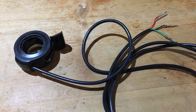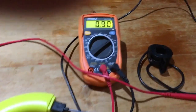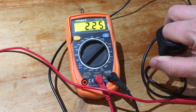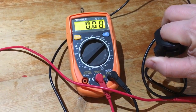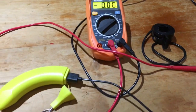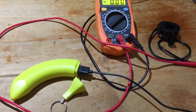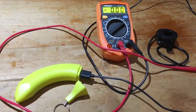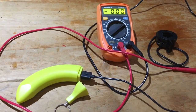So the throttle is resting at 0.9 volts before the BMS cuts out. I can probably scale it up to about 4.3 volts before the BMS trips on the old trusty banana power supply — so resting at 0.9 volts and then scaling up to about 4.4 volts.